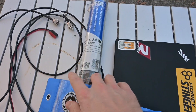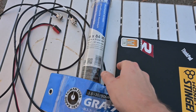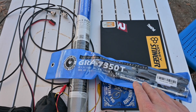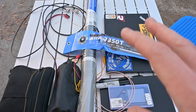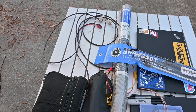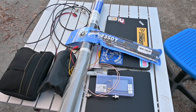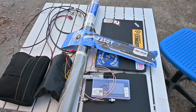There's been a lot of excitement about using a wire mesh screen in lieu of radials for vertical antennas. Today we picked up this 36x84 piece of aluminum mesh and we're going to set up out here and see how this pairs with our GRA7350T antenna. If it works well, it should make deployments on POTA and SOTA activations a little easier because we're not having to lug around a lot of extra wire to set up radials.